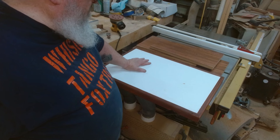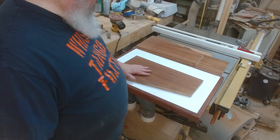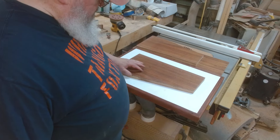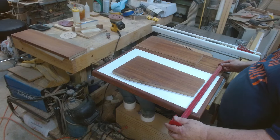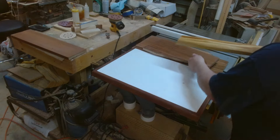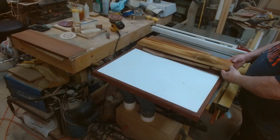With the exception of the drawer, I think I have all of my case pieces cut. I do need to put a roundover on these corners — just a mild eighth-inch roundover to soften them, because I don't want sharp corners. I need clearance back here for my jig for sharpening my tools, so I'm doing this with another piece of wood from the piano. This is rainbow poplar — 100-year-old rainbow poplar — and it's just absolutely gorgeous.